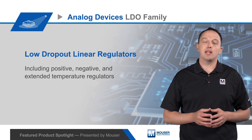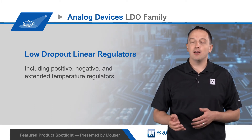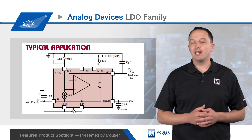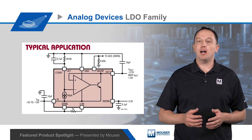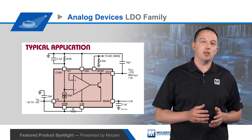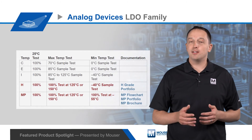Analog Devices also offers a wide range of negative LDOs with extremely robust performance. While it's possible to use a positive LDO to generate a negative supply, the topology leads to poor noise and regulation performance, and possible issues with supply sequencing. Negative LDOs offer many of the same features as positive LDOs, but are designed specifically for generating a negative output from a supply as wide as negative 1.5 to negative 36 volts. They are available with positive and negative shutdown logic, and dual output versions, such as the LT3032, generate both a positive and negative supply.